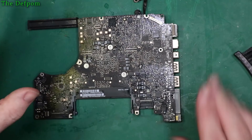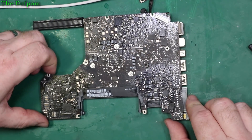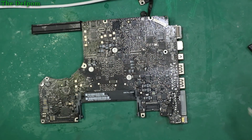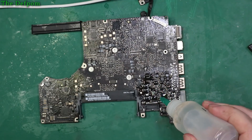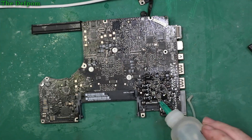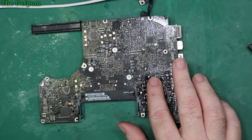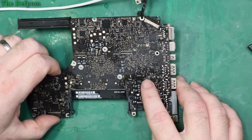So let's turn the power supply back on — it's still got lots of flux on it but I'm just trying to get some of the worst off in case there's any debris laying around which may be conductive. Let's power it up and we'll see if we can find any hot spots because we know it's definitely not coming on. Whoops, something over here is getting hot — some warmth over here. Soak in IPA and see what seems to evaporate off. The ISL6259 right there — that has some bubbling going on. So that chip there may be gone or it could be the circuit that's driving it is shorted. That's not exactly an uncommon problem.